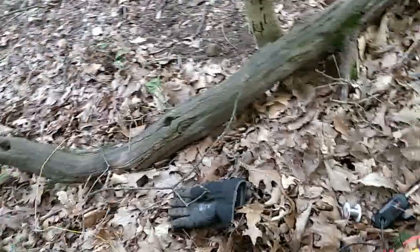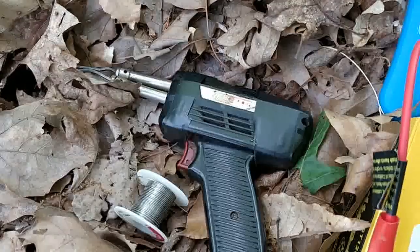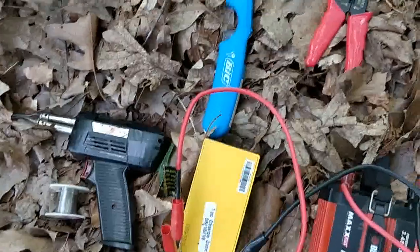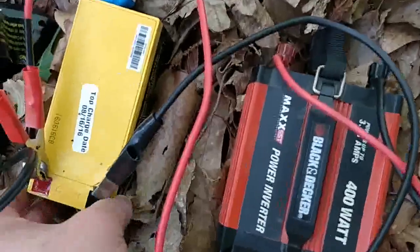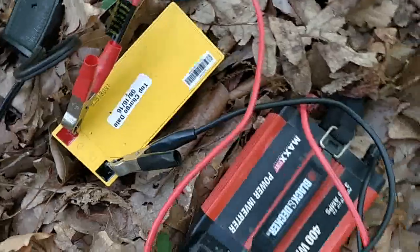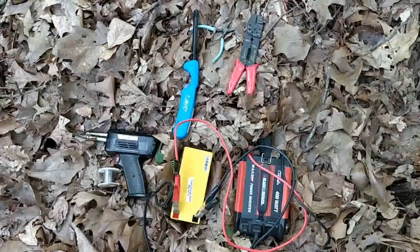How do you do that? I have a portable repair kit: a good old Weller soldering gun — which I actually dropped on the floor the other day and had to tape the bits back together, but it keeps on working — some solder, some shrink tubing, a lighter, pliers, strippers. To make it portable, just a little 12-volt battery — this is a 12-volt 4 amp-hour — and an inverter, a 400-watt inverter, to power the soldering gun. I'm going to go ahead and fix this one.